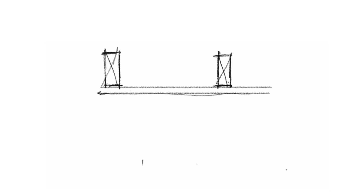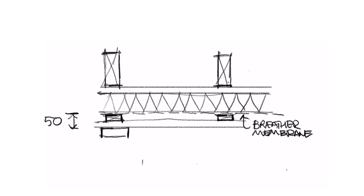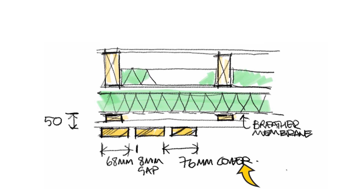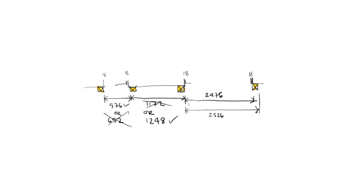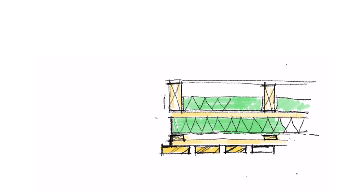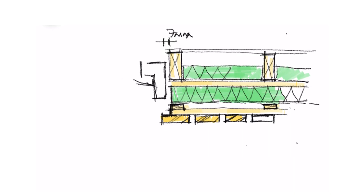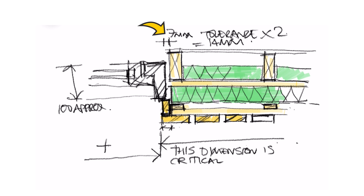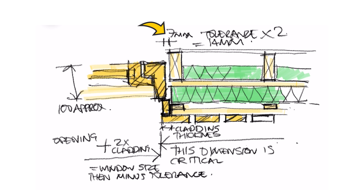An open cladding screen works best with an 8mm gap. I like a narrow board — a finished size of 68mm — with an overall interval of 76mm between each board. We call that the cover: 76mm cover. We'd call it centres if we were doing joist spacings. I'll use this size to work out my window dimensions and crucially before I order my screens, since I don't want to be cutting strips of cladding along their lengths. Consider a 14mm tolerance for your windows — about 7mm extra around the frame times two — giving you space to manoeuvre the screens in whilst fully covering the gap.